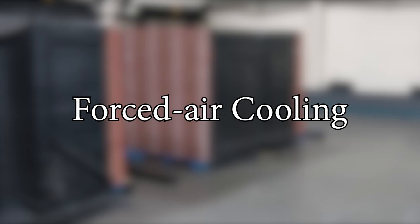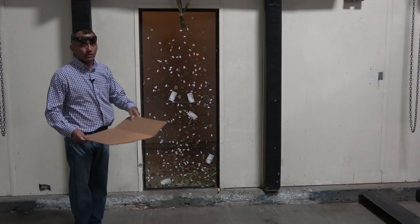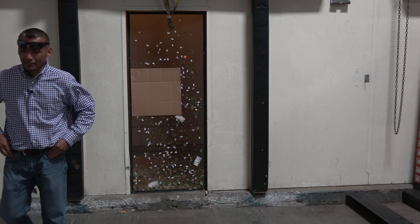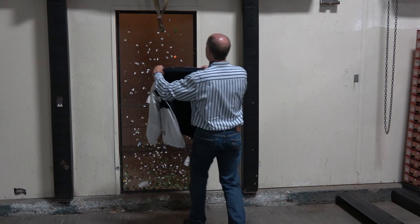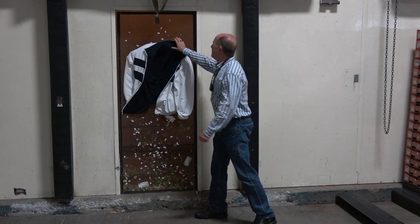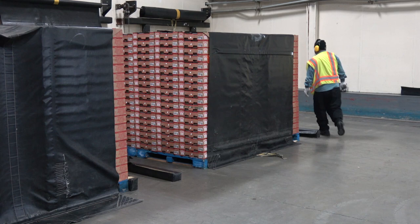When products cannot be wet, an alternative method is to use fast-moving air to cool them. Pallets of produce are placed on either side of an opening in a hollow wall, and a tarp is drawn over the channel between the pallets to seal it. When fans in the wall are turned on, they create suction which causes cold air to rush through the boxes of product and into the channel. The heat-laden air then rushes into the hollow wall, is cooled, and blown back out into the room by the fans, cycling back through the boxes to cool the produce further. This is a relatively slow but gentle pre-cooling method.